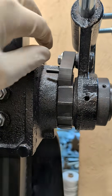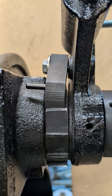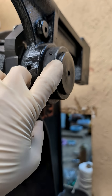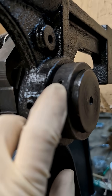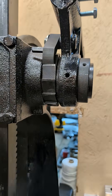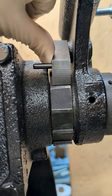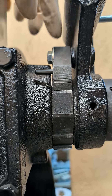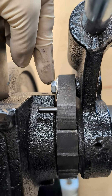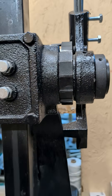The problem is this mechanism — it's so jalopy and bent. I modified this, and I also drilled it out here so that the locking nut would actually have something to get into. But this part here is the major failure point, so you almost need to weld on a bracket that comes off here and down here to make this double shear so that it could actually take that force.